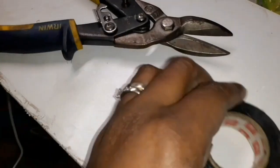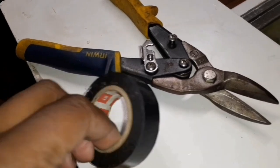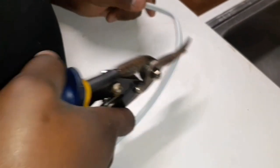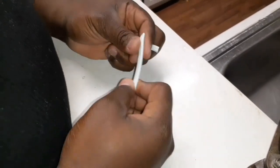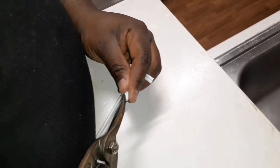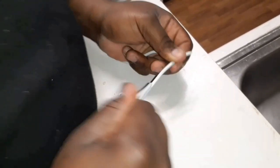Now for the down-and-dirty part. I'm going to use electric tape, and I have pliers used to cut wire. My husband is cutting the pendant light a couple inches above the switch located on the pendant light. Then you're going to cut this cord in half. The reason I'm doing this is because the lampshade is made of metal and I could not fit the cord through the top hole, so I need to get the cord to fit through there so the light bulb can sit flush at the top of the lampshade.